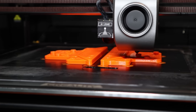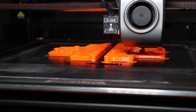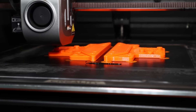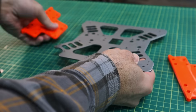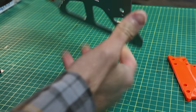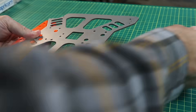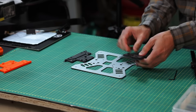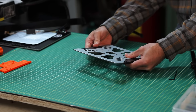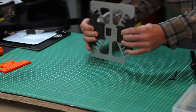It's time to print some parts and I'm using PETG here just to test it out. I think PETG is fine, but long-term ABS, ASA, or polycarbonate are probably better options for stiffness. My first set looks really good — they're from Orange Prism PETG. Unfortunately, I must have mixed up which side was the top and I have these bosses in the wrong place, so I'm doing it again from Galaxy Black PETG. And now they fit like they should, with just a little bit of clearance and room for adjustment.